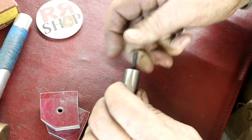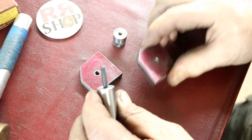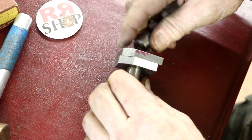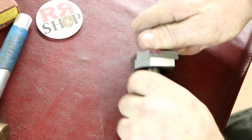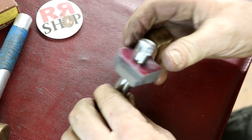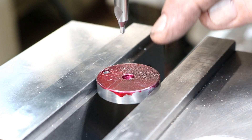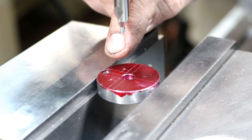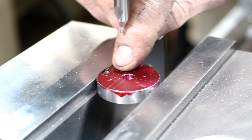We're going to screw in this little stud — I made it out of a socket head cap screw, just cut it off — then slip the crank webs on here and screw the whole thing together. I made a nice 9/16 hex on the end. I'll put that in the lathe, put a wrench on this, make it nice and tight, and we'll turn these ODs right on down. This is the finishing up of the crank web for the brass engine. I'm going to drill a couple of holes to give me the radius in the corner, then bandsaw the chunk out, and come back to mill it up and clean it up.